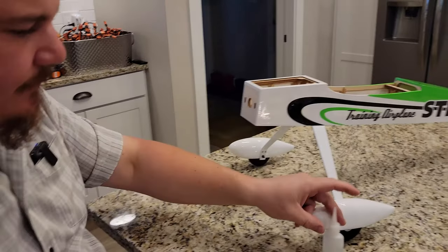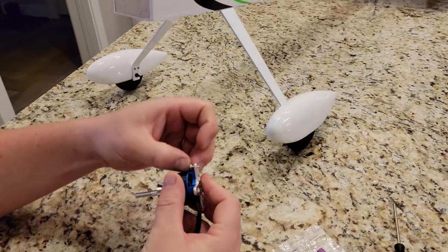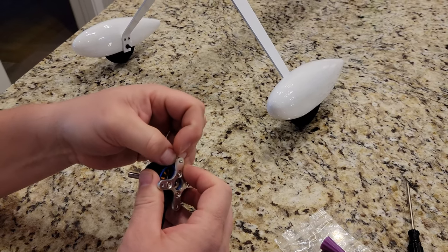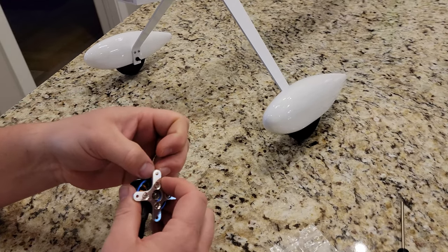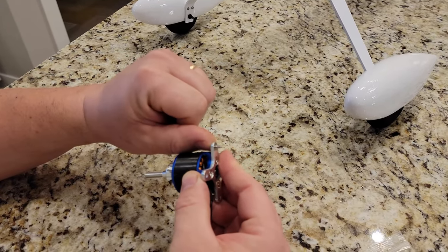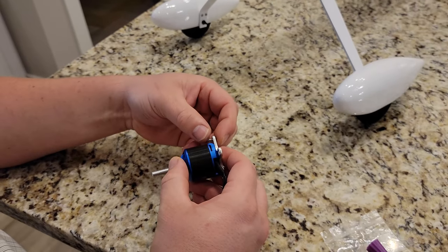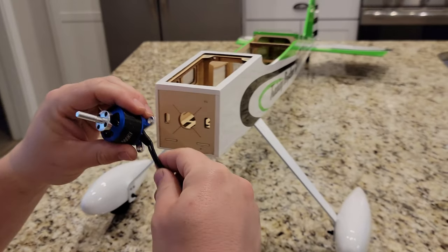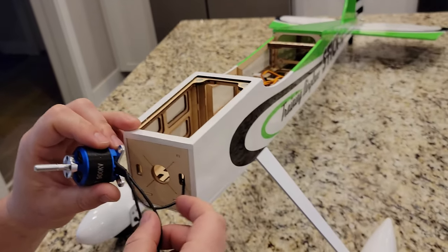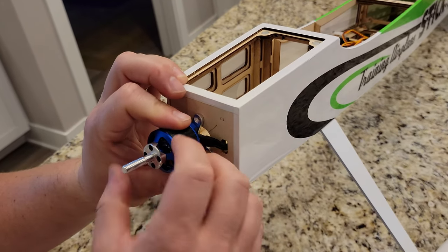All right, so now that's ready to rock and roll. The next step is we're supposed to mount it. They provide some screws here — these are the wrong type of screws, but they would work. Because they don't have the countersink, I'm going to prefer to use something with a countersink. Earlier we found some that had countersinks and couldn't explain why — well, here's your countersink screws. We're going to have good penetration with those. Now, this has the little laser-cut pattern here, so we're going to pass these wires through just to see how this lines up one at a time. There's one, there's two, and there's three — because if you try to do all three at once, it won't fit.